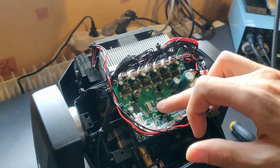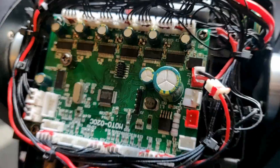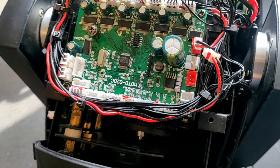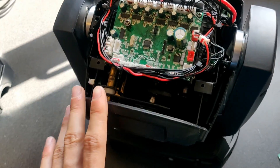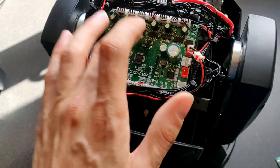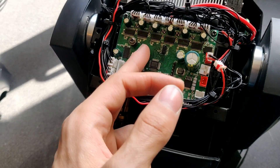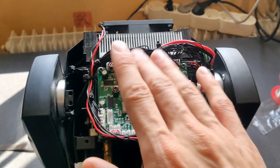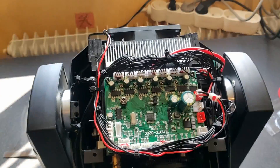We've got a little microcontroller here and what looks like some motor drivers, and a regulator. What I'm going to do is swap some motors, and that way I can check if it's a sensor issue, a motor issue, a cable issue, or a driver issue. I hope it's not a driver issue because I'm not very able to replace them — they're super tiny. Unfortunately, after spending 30 minutes swapping stuff around, I managed to isolate the problem and it's the fucking driver.